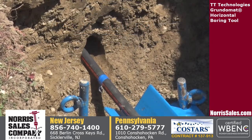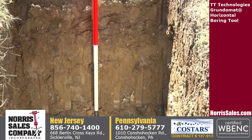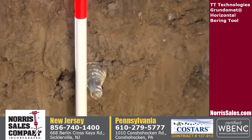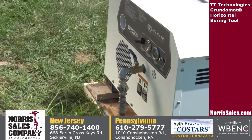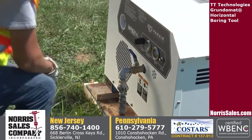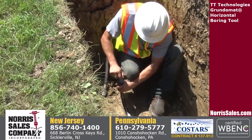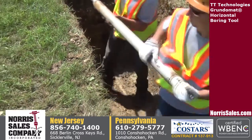During operations, monitor bore progress and check hoses regularly. Upon bore completion, turn off the compressor and bleed off the air pressure. Disconnect the tool from the air hose and make sure to cover the end of the tool using the blue cap to prevent any tool contamination.